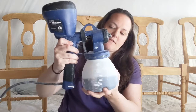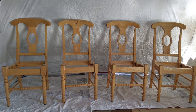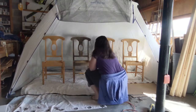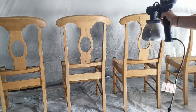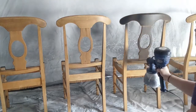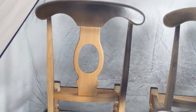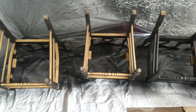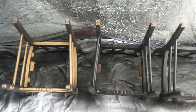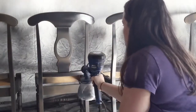Before you start painting, make sure you protect the area around where you're going to be painting. I'm using a large spray shelter in my basement, which is kind of like a big tent that keeps all of the paint in the area where you're working, but you can also use drop cloths and tarps. When using your paint sprayer, make sure you're holding it so it's facing the furniture head-on and then slowly move it back and forth across the furniture, slightly overlapping each paint stroke. Once your first coat of paint has dried to the touch, you can turn your chairs around to more easily reach the sides and back, and even turn them upside down to paint the underside of all of the rungs and legs. When painting any furniture you generally need to do at least two coats — sometimes three — to get really nice even coverage. Make sure you let the paint dry completely between coats.